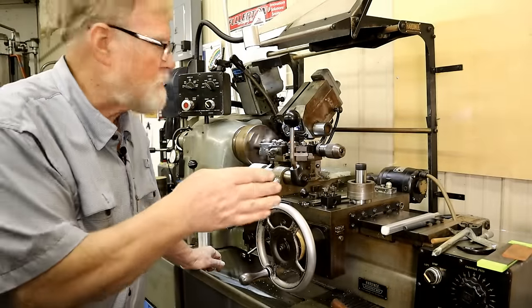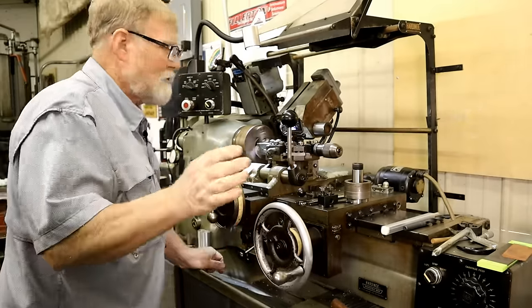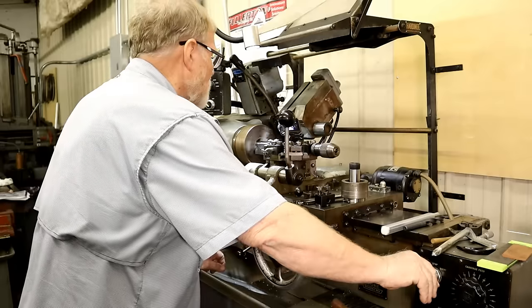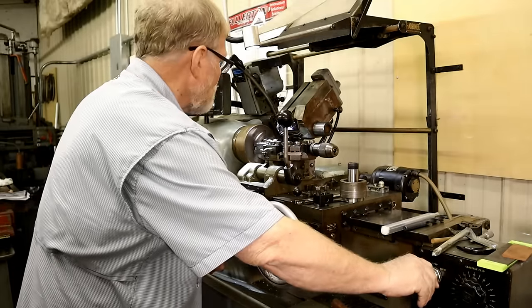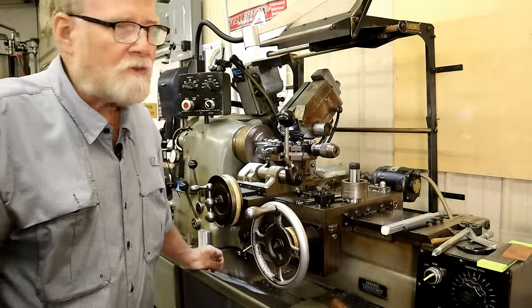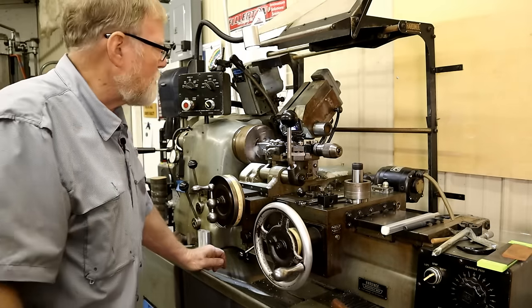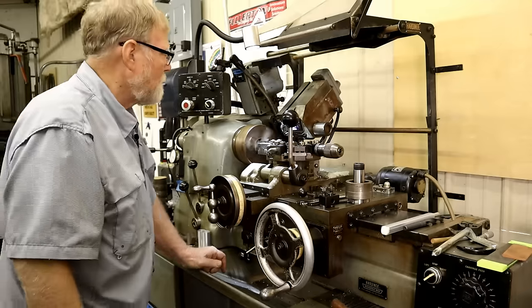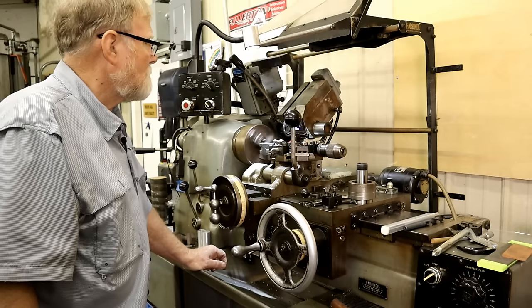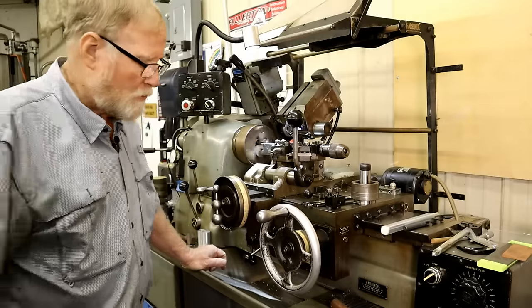And remember, when you're doing something that's sticking out that far from your chuck, it's only half inch thick. When it touches the tip of your cutter, it's going to push away from it. By doing some spring passes, instead of sitting here and automatically dialing another thousandth in, you eliminate that springiness of the material to some degree. So right now, I don't see hardly any material coming off of it, so I know we got rid of the spring.